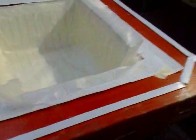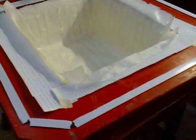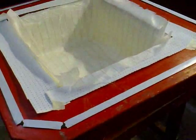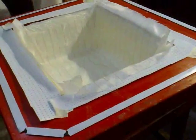I've just got a little bit more on there. The comb that's prone there for the resin run-off is going to be touching the mat that's underneath - otherwise it isn't going to work. You need a vacuum track to allow the air and the resin to be pulled through, so wherever you're pulling vacuum through or putting your resin in, it needs to be in contact with your laminate in some way.